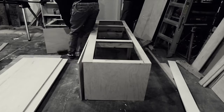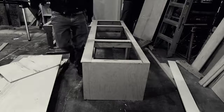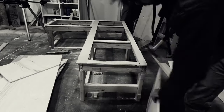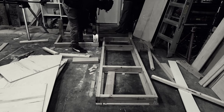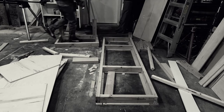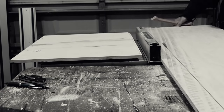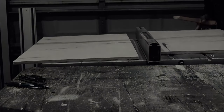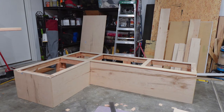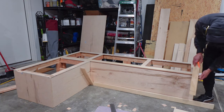Every project always has a major mistake, and I think I just miscalculated the height — the half-inch plywood on top of the framing, plus the bench top, plus the cushion, all combined would have made the bench too tall. For shorter folks like myself, your feet wouldn't be flat on the floor. So I had to take it all apart, hammer it out, and take about two inches off the plywood and the legs, then reassemble everything two inches shorter.